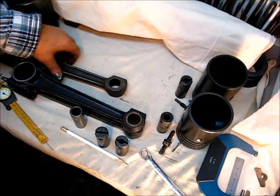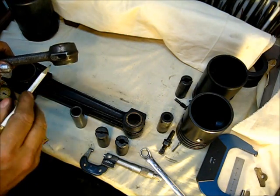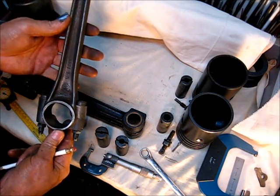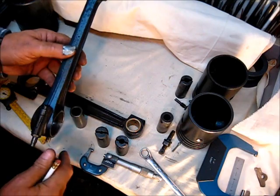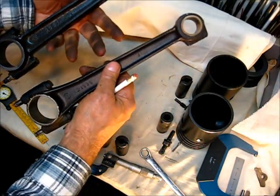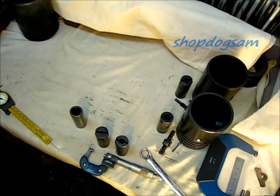There are just several different examples here. This is another one where the bushing has spun in the rod and the hole doesn't go all the way through — this is very bad. That's one of the things you should check when you disassemble the engine. If that's not open, just run a drill bit through there and you'll probably be good to go. You will find them with really thin castings on this end and also real thick castings — comparing those two together they're identical and pretty much all these are interchangeable.